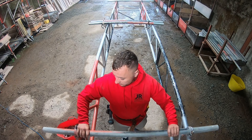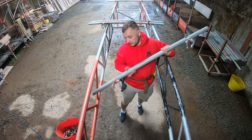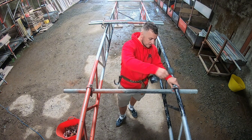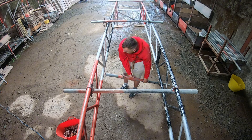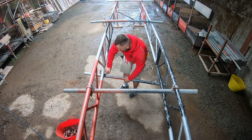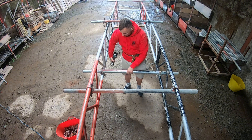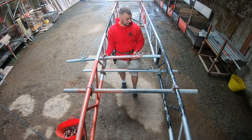Once you've made all these up — top cord every metre, bottom cord every two. Don't forget to put them underneath, because your trannie is on top and then your boards on top of that. So this goes underneath here, and these go every metre on the top cord. And then these go every two metres on the bottom.